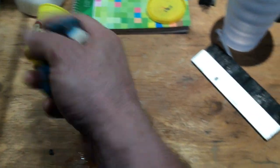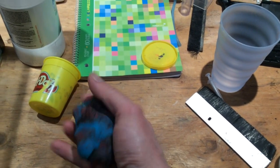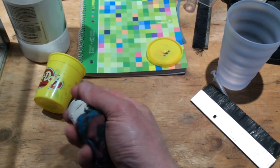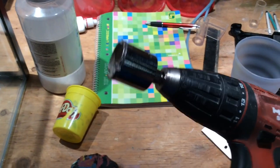The other thing you're going to need is Play-Doh — I got my kids' Play-Doh. I don't have any plumber's putty, I'm all out, so I'm just going to use this to make a seal. I have to put water in while I'm drilling — I'll show you that in a minute. And you need a drill with a diamond tip hole saw blade, same size as your bulkhead.